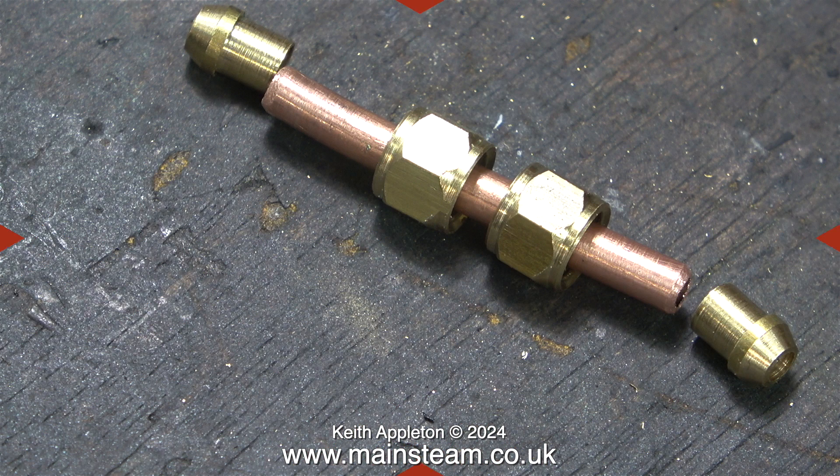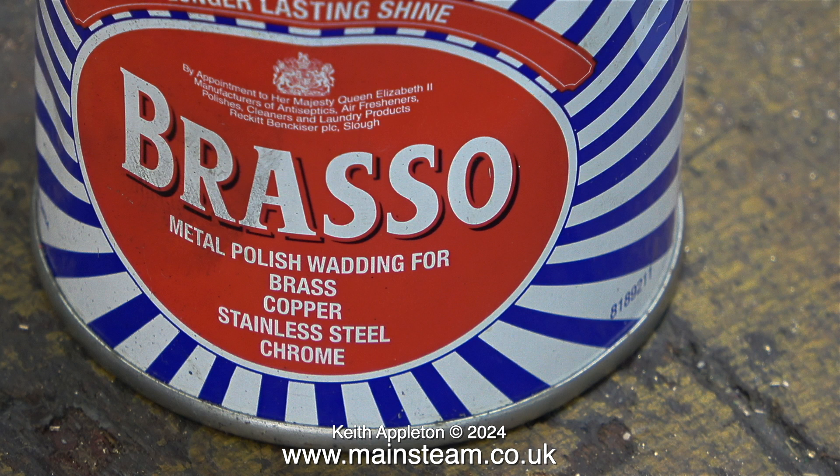In this clip I really did make a fundamental error — can you see what it is? It actually meant that I had to make this part twice because the first time it was no good. I got there in the end: I silver soldered the parts together, cleaned them up first with a piece of Scotch Brite, then used the polishing spindle and finished the job off with some Brasso wadding.